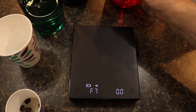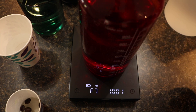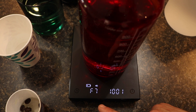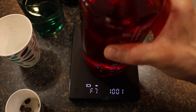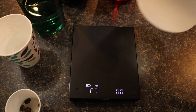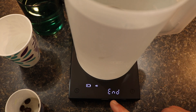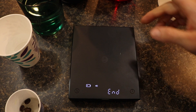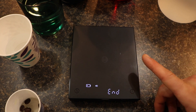F7 — I've struggled with this so bear with me. You put 1 kilogram in the middle of the scale and you should just let it sit for a period of time, and then it should pop up and show F8. The other option is to have the 1 kilogram on and then put the 2 kilograms on directly and let it sit until it pops up. And it pops up as 'end.' So basically that last F7 step: you put the 1 kilogram in the middle and then switch it out for 2 kilograms and you should be good to go.